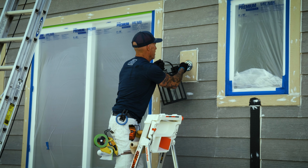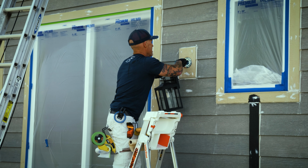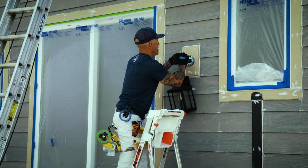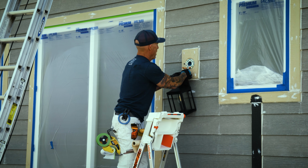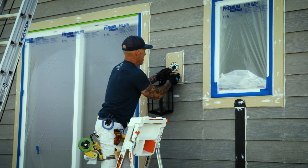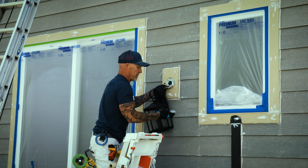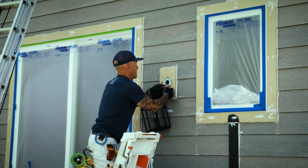Light comes off. I'm going to pull wires out. They're wire nutted together. I'm going to take my little nuts and put them back on here so they don't get lost. Now I'm going to begin taking off my wires. So I'll take my ground wire, wearing the rubber gloves, so if there was power on, it would keep me from getting shocked. I'll take my wire nuts, put them back on the end, and tighten them on there.